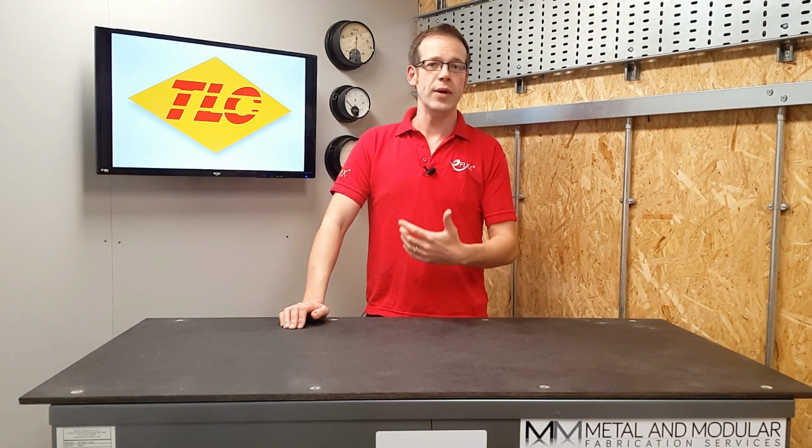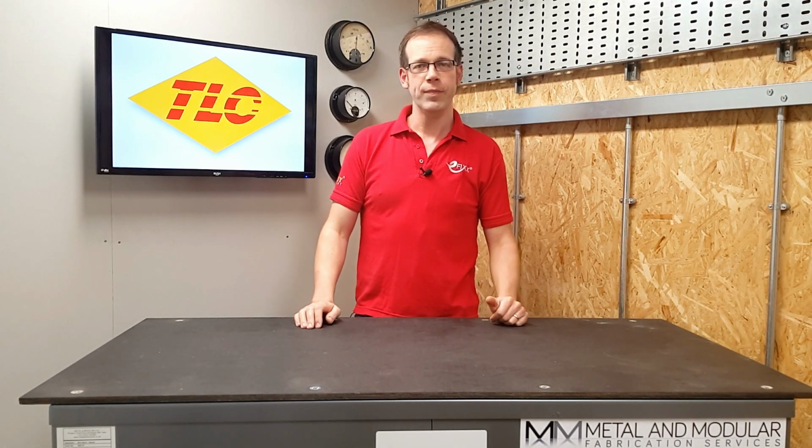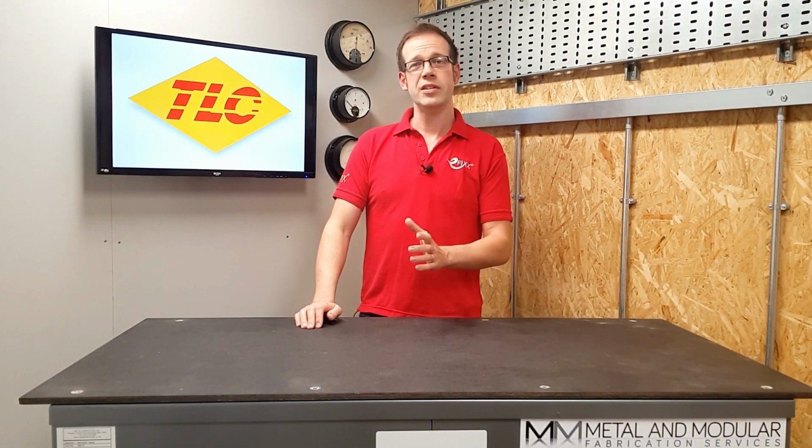Now for this, we just need to think about what could happen if we run mains cables by speaker cables. It's possible that when 230 volt loads are being turned on and off, the change in current in the cables and the change in the associated magnetic fields around the conductors could generate electromagnetic interference in the cables and cause pops and crackles in the audio system. Also, even just large loads continuously running could cause an audible background hum in the speakers. It's possible that if the mains cables are only supplying very small loads that don't switch on and off a lot, then you won't have any problems with interference.